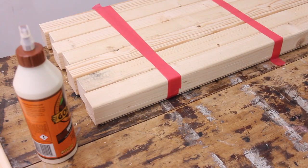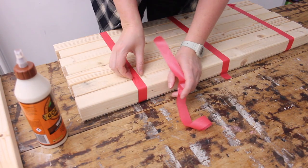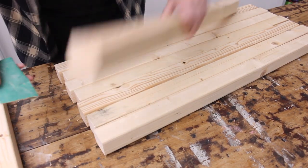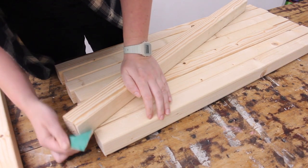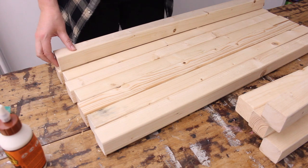Just make sure they're a little bit more sturdy to work on later. While I wait, why not have a cup of coffee? Take away the masking tape and just keep doing what you were doing. What I did forget to mention before is, before you stick the piece of timber down, make sure all the edges are really nice and smooth — it's so much easier to sand them now than when the table is in place. So keep adding your glue, a generous amount of Gorilla Wood Glue.